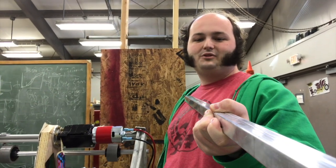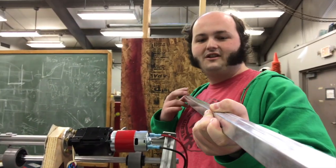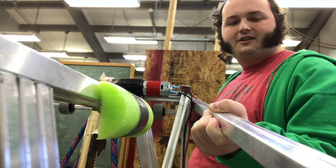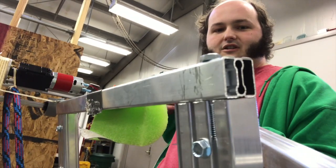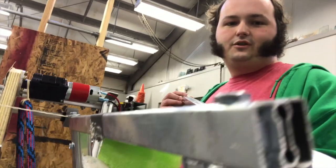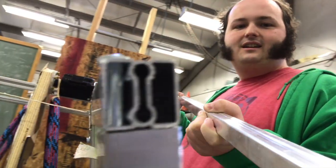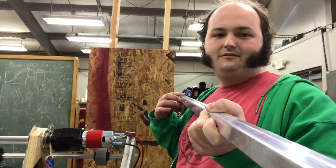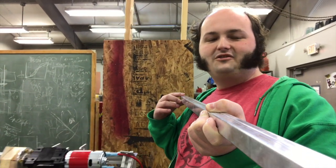The bulk of the structure of the wings that deploys is made out of Andy Mark's peanut extrusion and the brand new walnut extrusion. These two bolt together using 1/4-20 thread forming screws, which you can also use just with a tap. We use a drill tap on a lot of these holes that allow us to sink screws into the ribs of the peanut and the walnut. The structure is extra strong and was able to hold more than 150 pounds, which is more than you'll see on a competition robot.